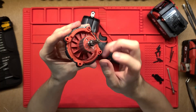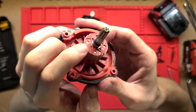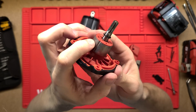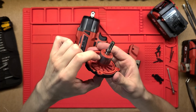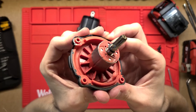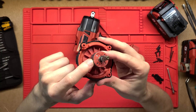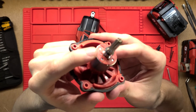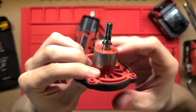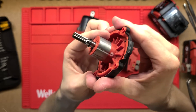The balancing for this rotor was just done on the plastic up here — you can see these grooves were just carved out of plastic and not out of the actual metal. On a lot of cheaper brands and cheap motors you see the actual metal being cut out in order to balance it, but Milwaukee's manufacturing precision is so precise that this is manufactured well within tolerances. They just have to take out this tiny little bit of plastic right at the top, which has very minimal weight and minimal inertia, to balance it so this spins as nicely as possible within those tolerances.